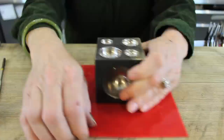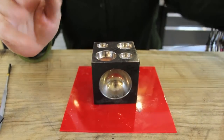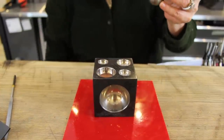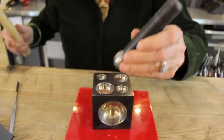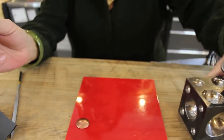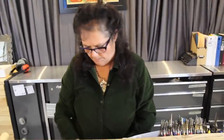I'm going to use the urethane block that came with the Pepe disc cutter and put the disc in a biggish hole. I'm only going to use one size dap — smaller than the hole area but not real tiny. I don't want to come in with something too small; I want something that more fills the hole. I'm going to use my trusty mallet and give it a couple of whacks. This is 20 gauge so it's a little harder to dome. I'm going to anneal it and then move to the next hole with a smaller punch. You can make huge high domes if you want for your cabochons, but for what I'm doing I'm just going to dome it a little bit more.